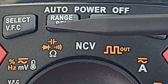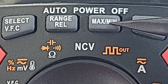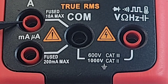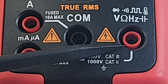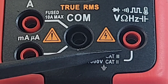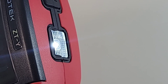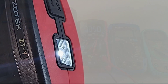Finally, microamps AC/DC. At the top of the meter, we have our select and variable frequency control, range, rel, max/min, and also hold/flashlight. At the bottom, we have our four input jacks: high current up to 10 amps; milliamp and microamp; common ground; and on the far right, diode, signal out, continuity, temperature, voltage, resistance, frequency, and capacitance. This little guy is loaded. And by the way, the flashlight on this multimeter is actually usable — very bright with a good bead of light. Size-wise, it's definitely not the biggest multimeter out there and not the smallest — sort of in between, but definitely a portable meter.